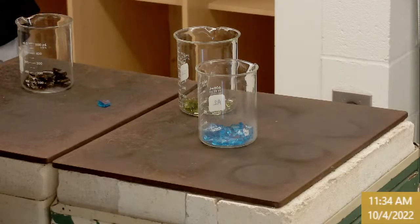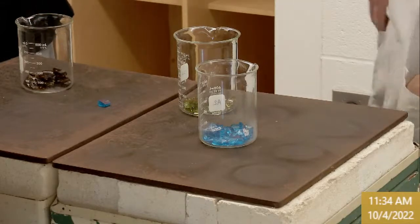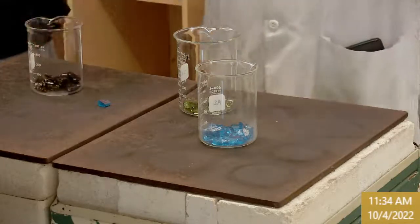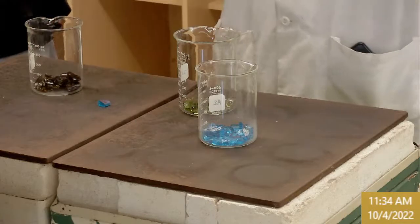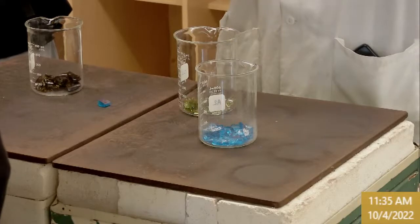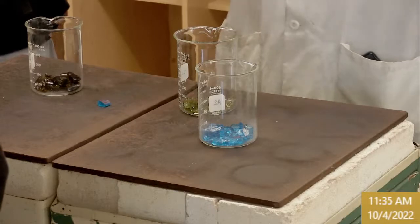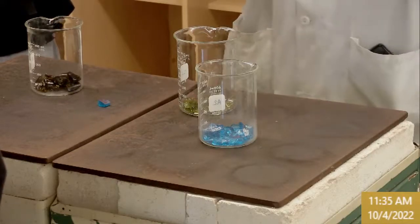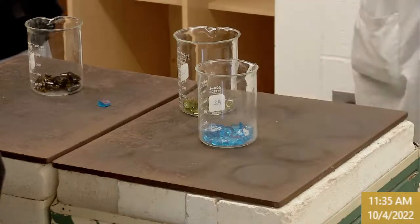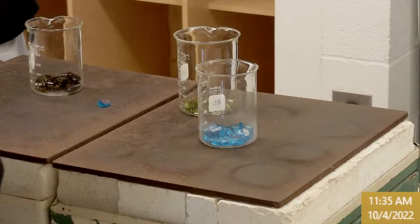I'll check the spreadsheet and see. Unmelted batch is the enemy for glass because as it cools and all those tension bands start tightening in, now it's pulling against a bubble. Well, the bubble can give, and the force distribution is way different on an internal void than it is on the body of the glass. And so then it just basically rips it apart. One of the bubbles finally cracks. Shatters. This was fun. All right. See you guys later.